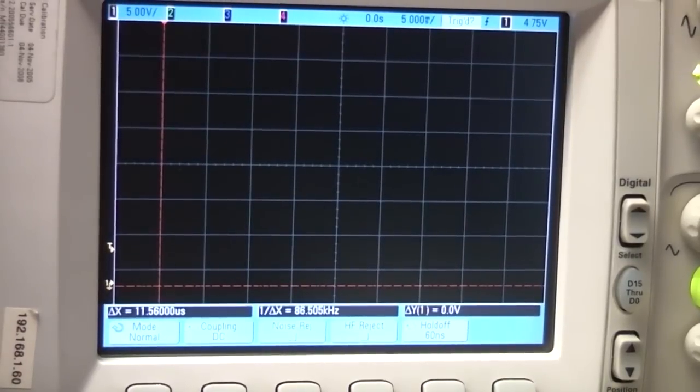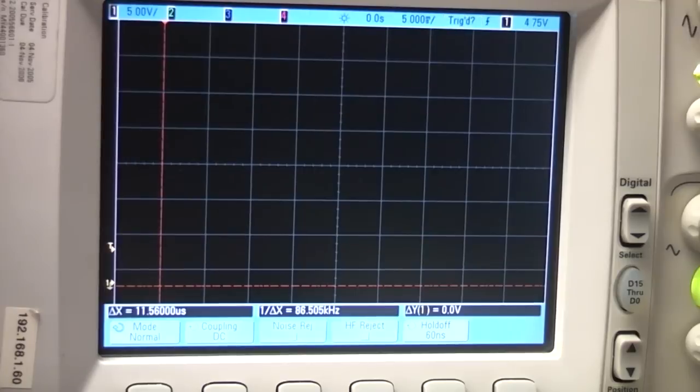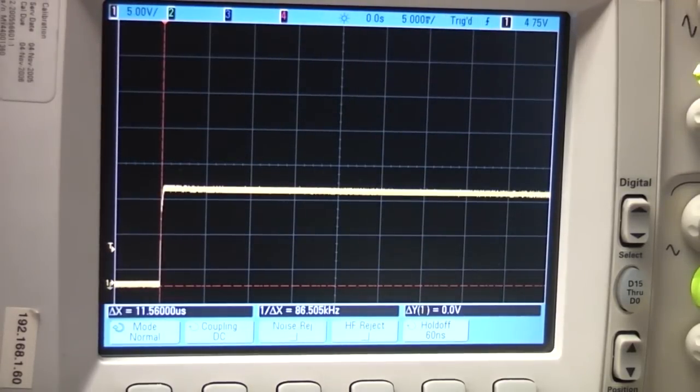One quite important consideration for a bench supply, and something where some of the cheap ones fall down quite badly, is you need to make sure they don't overshoot to produce any spikes, both when you turn it on and also when there's a sudden change in load. So I've set this to 12 volts, I've put a nominal 10k resistor across it because there is a little bit of capacitance across the output, so if you turn it off it takes quite a while to drop down. So I'll turn it on, and that looks fine, there's no overshoot at all.